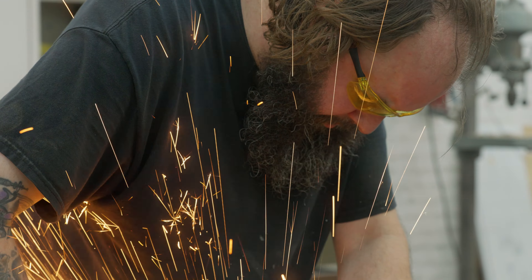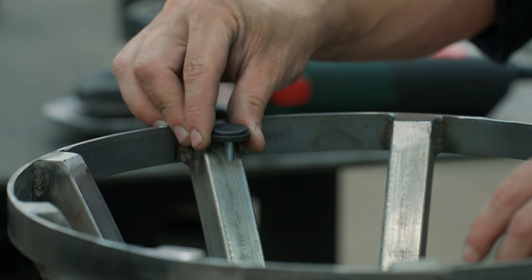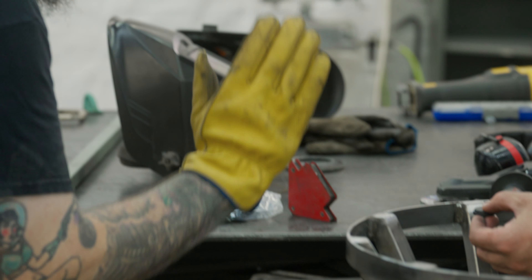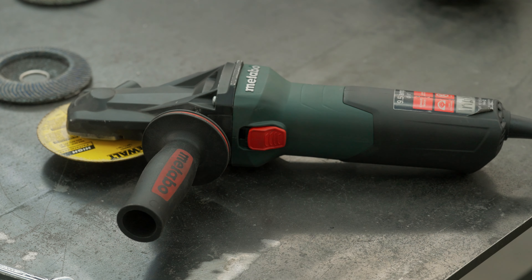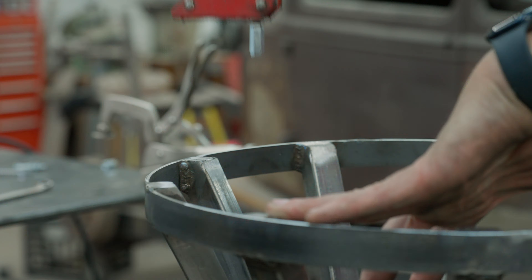The feet for the pedestal base for the high-top table used a slightly different approach — we attached a threaded coupling rather than a nut and a washer. The reason was that we didn't have any space for the bolt to go inside the metal tube of the leg, so we had no choice but to put the bolt on the outside. With the help of a big red magnet to hold the threaded coupling in place, I attached them to the table legs. Once attached, I tested the feet I bought to make sure they threaded through — and thankfully, they did.